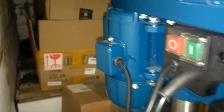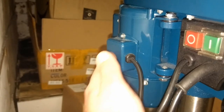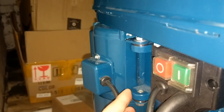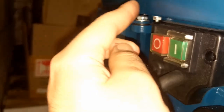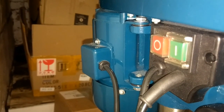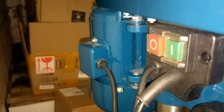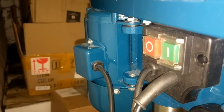Also, as you can see, the motor mounting place was slightly smaller than the motor holder. I printed two millimeter washers to put underneath, since it used to have slight vibration, so by adding those washers, now it is a lot better, no vibration.